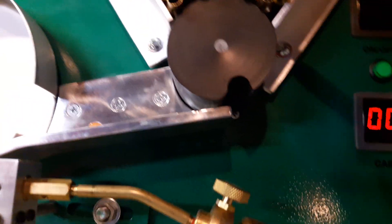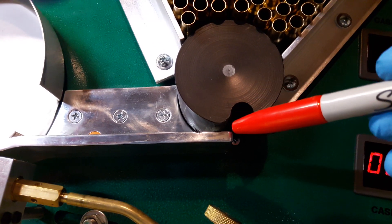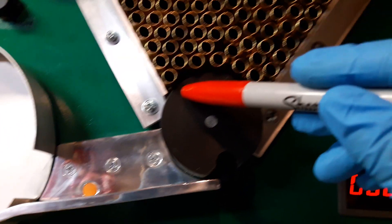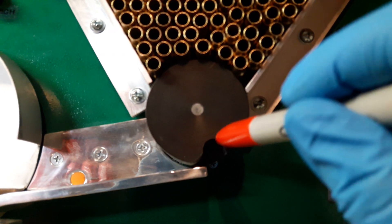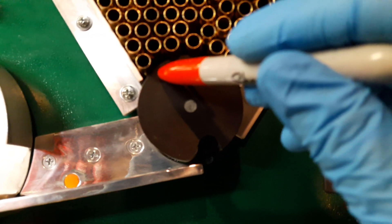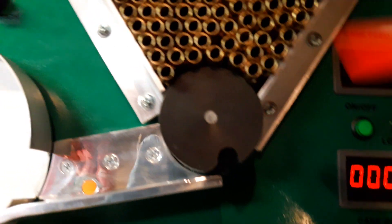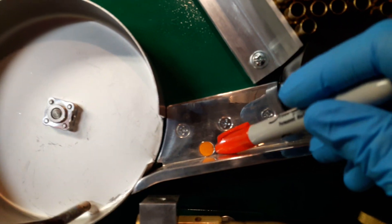When making your drum, if you have access to a lathe and mills, after you machine it out you need to radius this section. When the drum spins and drops a case in, the radius allows it to clear other cases as it comes around. This is a universal drum — it picks up anything from .223 and up that'll fit. Without the radius, a sharp edge will catch the smaller cases and cause the drum to stop. You'll see the cases kind of float up and down due to that. Here's my proximity counter and the counter display, along with the reset button.